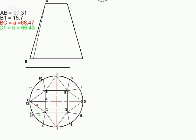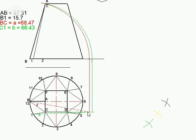All right, so let's determine the true length of this A line, C12, or one could even say CB. The length would then be, by putting your compass on B, opening it to point C, because we can add point C here as well as point F, C being in front, F at the back. So I'm opening my compass at point B, opening it to point C, and I drop myself a construction line, as can be seen with that red line here, and that red line going down. C has moved to the right-hand side.